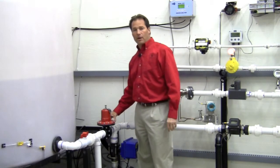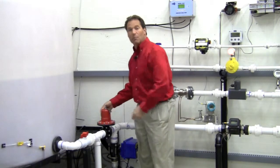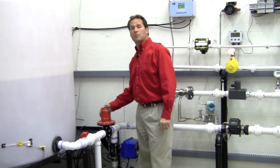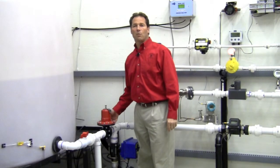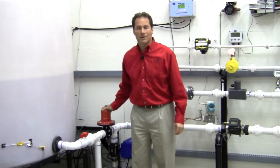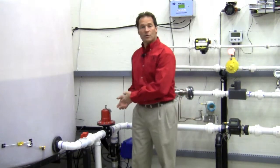The larger the diaphragm area, the more sensitive the regulator. The lighter the spring, the more accurate the regulator. Every manufacturer has access to the same spring manufacturers. We can make our diaphragm as large or as small as we want for sensitivity purposes, but what other manufacturers without the sliding gate design cannot do is make their stroke shorter.